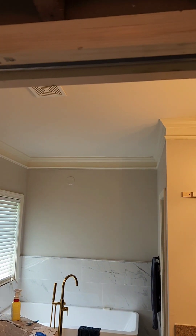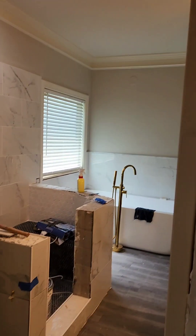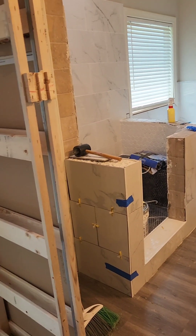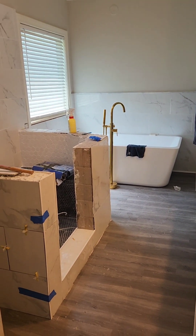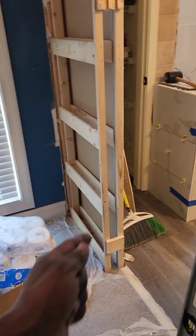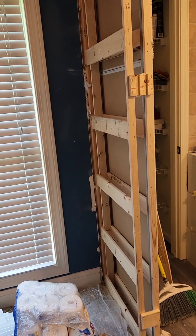I put the 2x4 in. I haven't put the header in yet, which I should just go ahead and do — I'm getting ready to put it in now. Once you put your header back in, you can mount the door. I'm not mounting this yet, I just have it sitting in there. Some of you saw the bathroom before — you can see it's coming along, still got some stuff to finish. The tub got in, that's the biggest thing. I'm gonna take this out, put that header in, and then probably mount it — I'll turn you back on when I mount it.